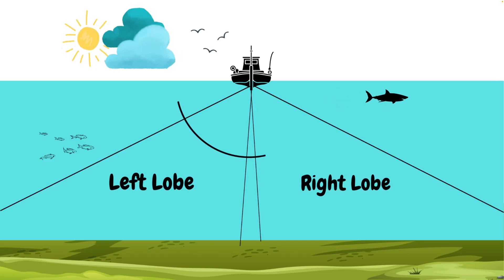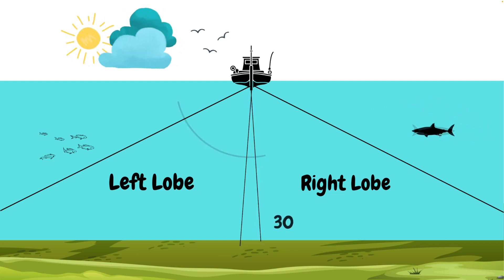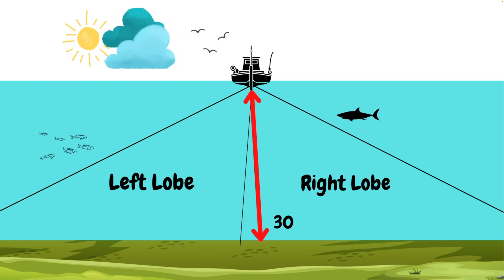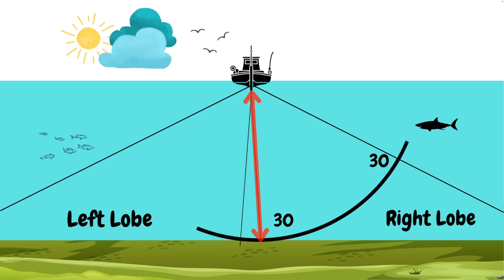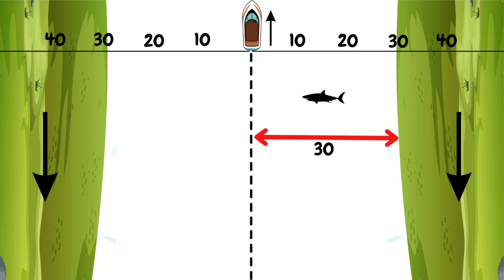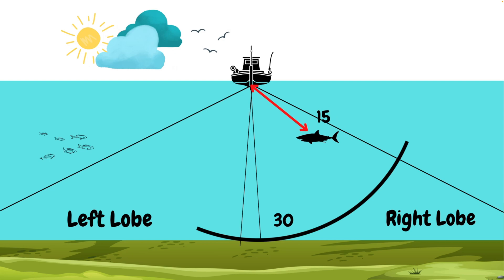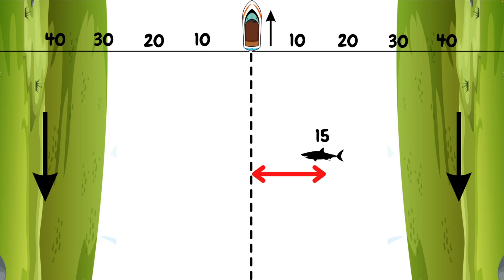The bottom starts exactly below the boat. For example, if the seabed is represented 30 meters from the center of the screen, this means the depth under the boat is 30 meters — confirmed also by the conventional depth sounder. The water column not only shows fish directly under the boat but also includes those in an imaginary arc expanding laterally. Because the beam of the side-scan sonar is very narrow, fish will not appear as arcs as with a traditional echo sounder, but as small bright dots. These dots indicate a fish is on either side of the boat but do not provide its precise location.